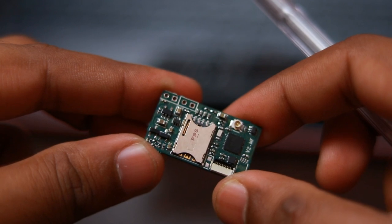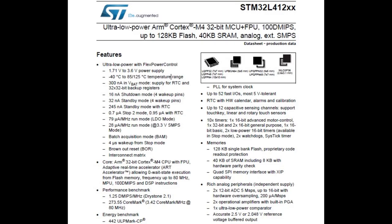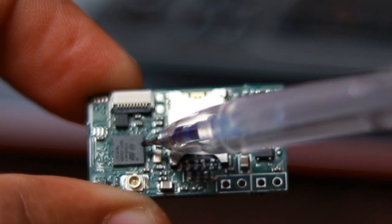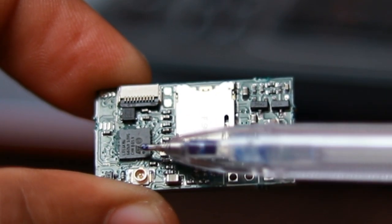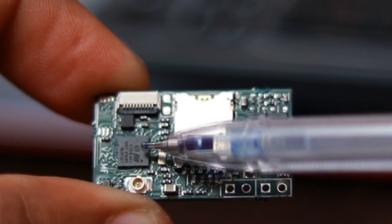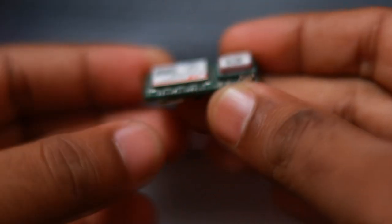The V2MF also supports Google Cloud platform. We tested the device by changing the MCU to an L4 series, which needs more capabilities in terms of code memory and data memory for storing keys and processing encryption. The STM32L051 MCU can be replaced with the equivalent STM32L412 series for supporting Google Cloud platform. They are both footprint compatible, so we don't need to change the hardware for that — the rest of the hardware remains the same.